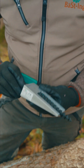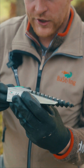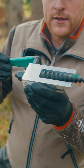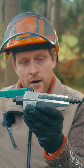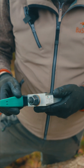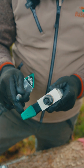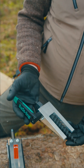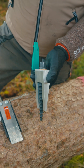Here we have the Minifix — a thrust cone wedge that pulls itself into the tree with the thread, and the force is laid on the aluminium wedge. Greasing is very simple with just one single grease nipple. The lifting capacity is hard to specify as it depends on the wood — in harder wood it pushes more. We have two nuts to drive: a 10 mm socket and a 24 mm socket, compatible with the Fallfix and Fallfast. Also very helpful if your chainsaw gets clamped in a tree: take the impact machine and Minifix from your belt, it pushes itself into the cut, opens the cut, and you get your chainsaw out — a very helpful tool in the forest.